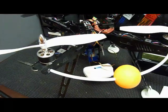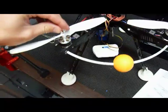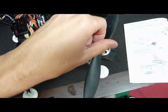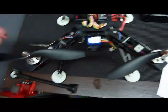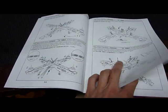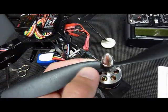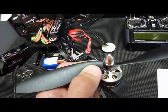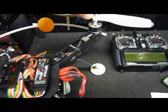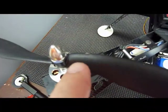When you're looking at the quadcopter from the top, motor number one should spin counterclockwise, motor number two clockwise, motor number three counterclockwise, and motor number four clockwise. In the package, you'll see two props marked R eight by four and a half. These R props go on motors two and four. The props on one and three are normal — not reversed. R stands for reverse props.